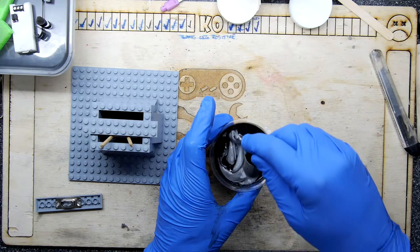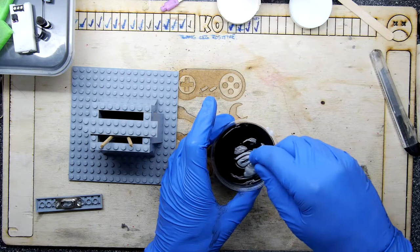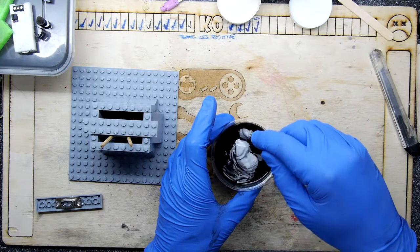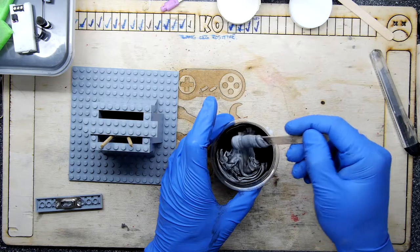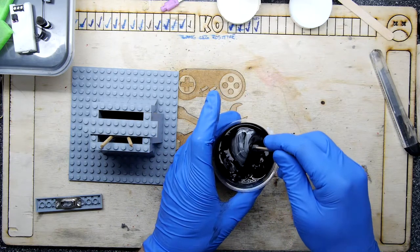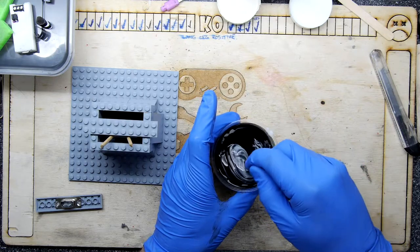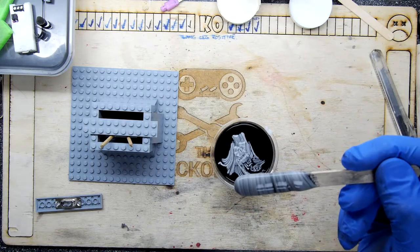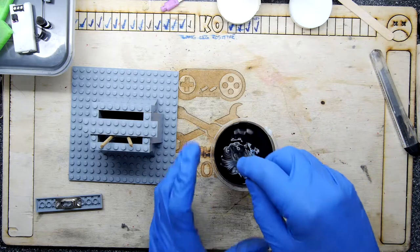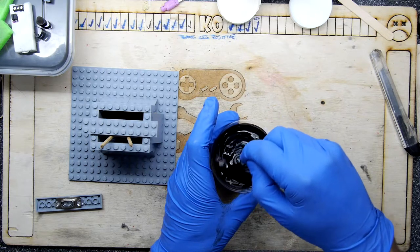So I'm probably going to stand on my stool, which I'm sitting on, of course, and I'm going to attempt to get a stream of silicone firing down past the camera and into the mold. This sort of jig, I don't know what you call the thing that I'm molding the mold with. The purpose of that is to get the stream. If you can imagine this is going into your mold, the higher you can get, the thinner. So you can see it's getting really thin. And if you can get it super thin, no air bubble can exist in it. The air bubble will pop on the way down.